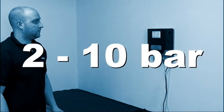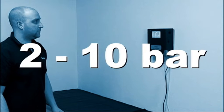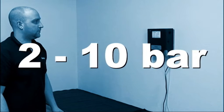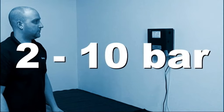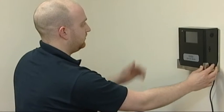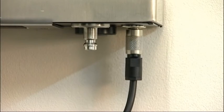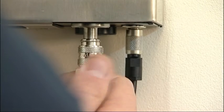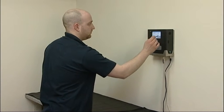If the unit is overpressurised, it will automatically shut down and display an overpressure warning. It will then need returning to the manufacturer for checking and resetting. Please note that when the unit is first supplied, or has been disconnected from the air supply for any period of time, you need to allow at least 30 minutes for the instrument's cells to have sufficient time to purge.